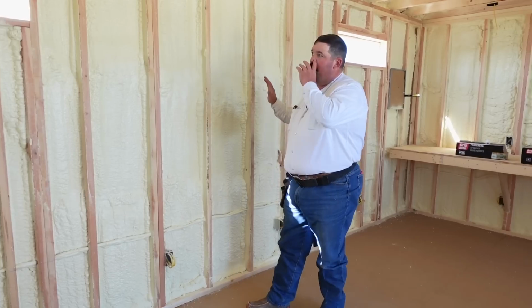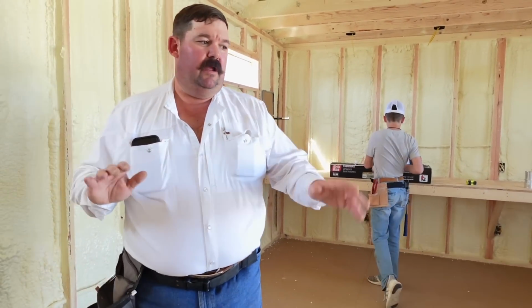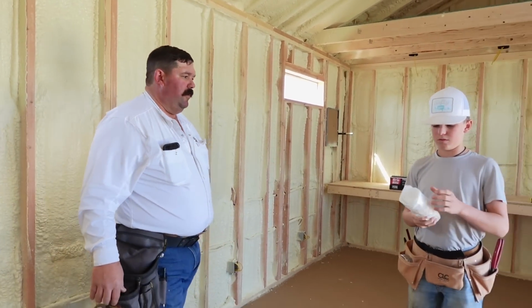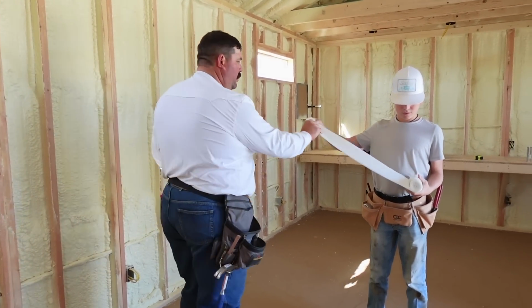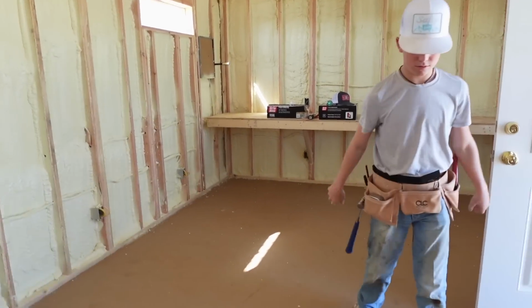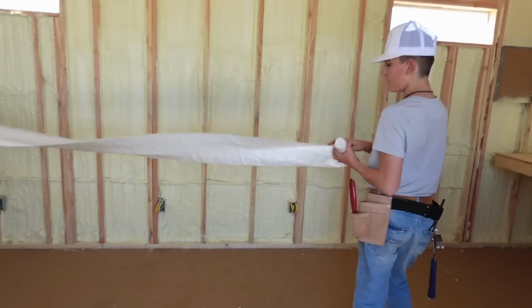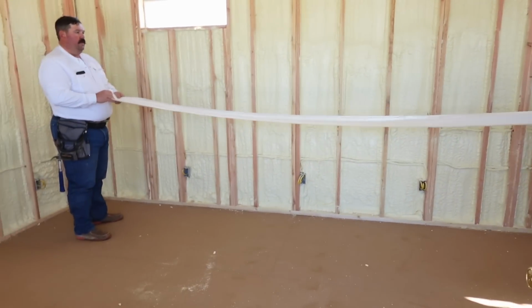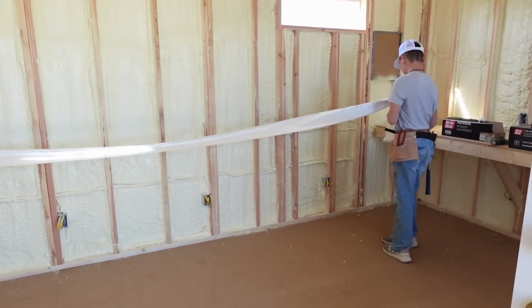Then when we put our plywood up on the walls, it's OSB. When we get finished and after we get through painting, we just take a razor knife and trim it off. Then we put a piece of 1x4 trim around the bottom of it, baseboard around the bottom, and be done. So, here we go with that. Is it long ways? Yep, it's 20 foot long. It's just barely going to fit. We should have about 3 inches on each side.